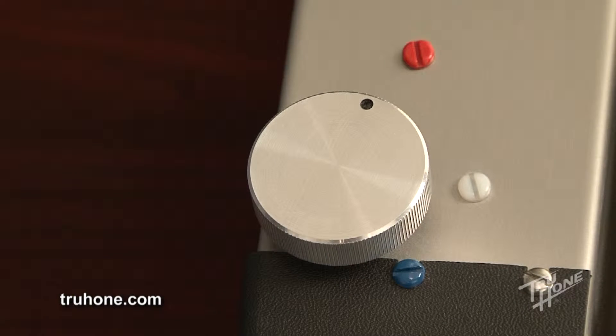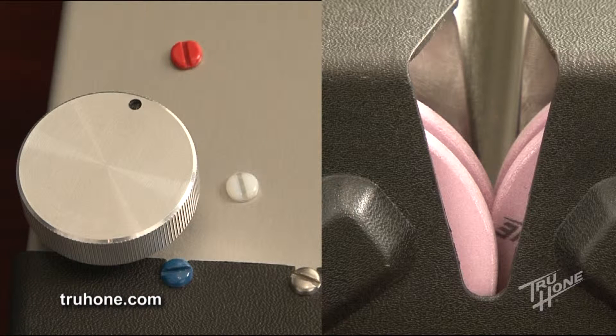To set the honing wheels, turn the angle knob so that the indicator mark lines up with the red dot. The red dot is always the reference position for setting the honing wheel overlap. From the front of the True Hone, visually check the honing wheels for proper overlap of approximately 3/16ths of an inch to a quarter of an inch, or 4.75 to 6.3 millimeters. This is referred to as the 3 bevel or the 4 bevel.